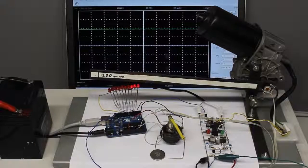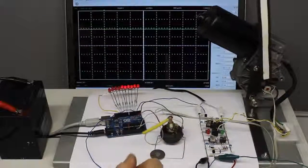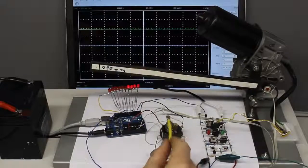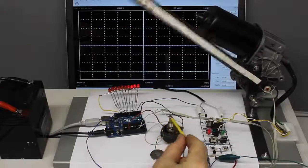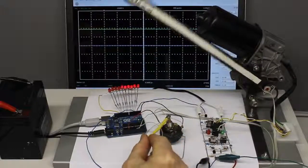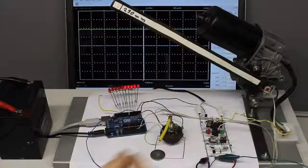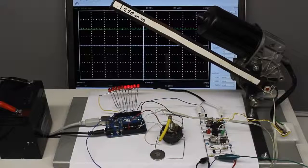The microcontroller can be used to raise the servo speed. A simple solution is to widen the voltage interval in which the wiper motor is turned off by changing the software code. Now, the servo doesn't oscillate even at a supply voltage of 12V, but as you can see, the precision of movement is poor.